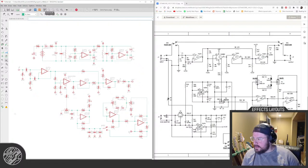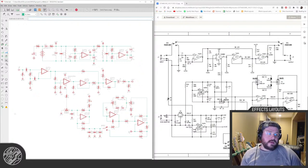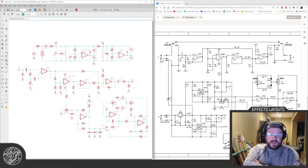I think that's the schematic all wrapped up. I should be able to fit this in a 125B, no problem, on a double-sided layout. When we do the single-sided, it'll probably be a little bigger. Probably a 1590BB or something, because I might have to split some op-amps into duals instead of quads. It's not an overly complicated circuit, but there's enough going on.